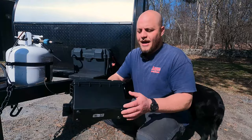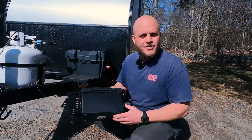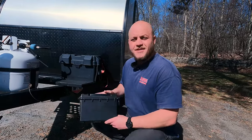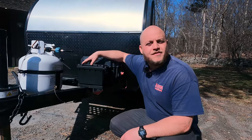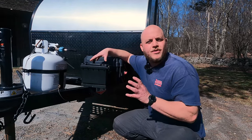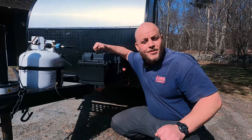Although those ways are easy, I prefer installing my charge controller in this cheap little box. You can get them at Harbor Freight — I got this one on Amazon for 10 or 12 bucks. I do a couple of cable entries but it's not necessary. Since the charge controller is waterproof, I'm going to mount this box in front of my battery box. I'll make the connection to the battery into this and the connection from the solar panel. This keeps the mud, snow, and ice off the charge controller, makes it easy to read, and gives me extra capability to use this with a portable power station.